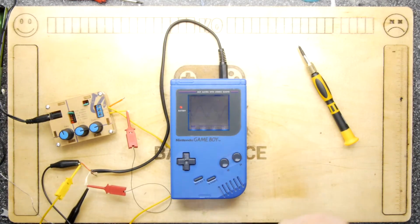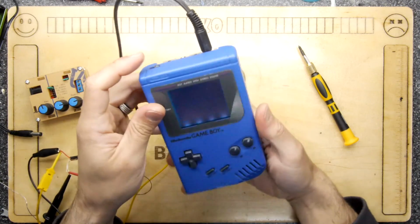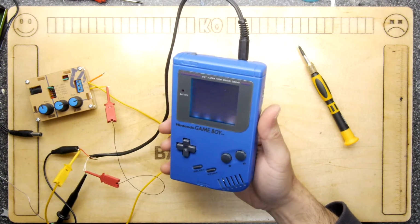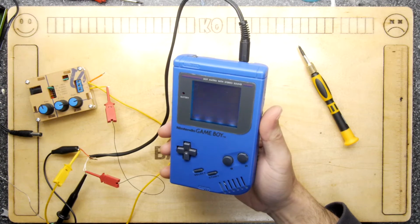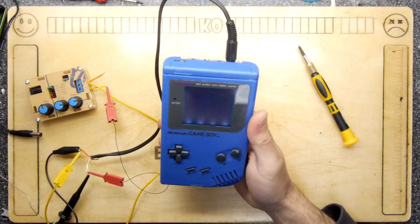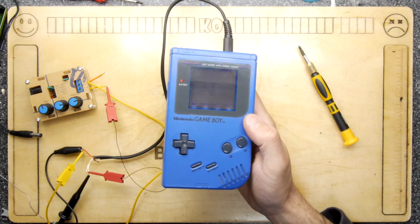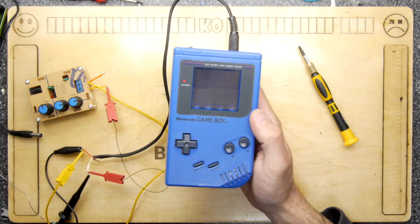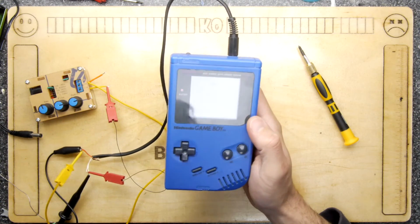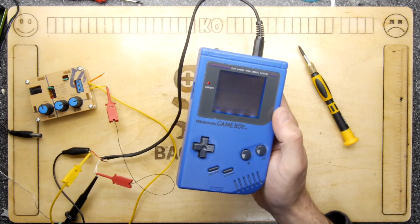The question though you're asking, is this useful for anything? I'm going to say maybe. I don't know if it's got the 100 kilohertz range. It's probably good for audio-ish things or slow switching things. So you could use it as a kind of a voltmeter and a field oscilloscope for kind of slow things. But if you're imagining you're going to work it on crystals and clocks, you probably won't see that. But you might see the transistor switching in a suitable sort of circuit for that.